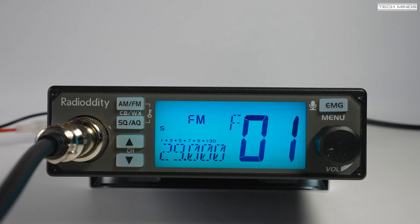With the case back on, let's test the power output. We're on 29 MHz — more or less in the middle of the 10 meter band — and we're on FM. Low power provides an output of around 3.4 watts, medium power provides around 7.5 watts, and high power provides an RF output just a smidge under 17 watts. Not bad at all.